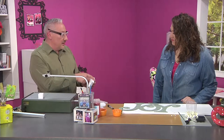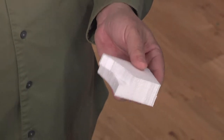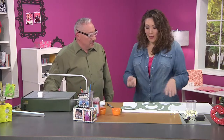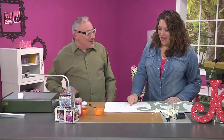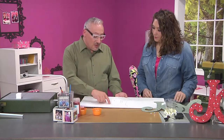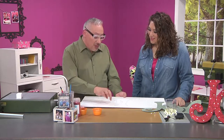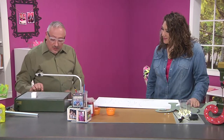There I've cut two pieces at once and it's perfect. So that means if I were going to assembly line these and make a whole bunch of them, I could actually cut even the curvy shapes stacked together and just make a ton. So now I have a question for you — how do you cut out the inside of this? There are two ways. We can either just cut a straight line, go all the way around, and then turn it off and let it cool. Don't try to go back through the same hole because you'll never do it. Or we can drill a pilot hole, and the wire sits inside that little hole.